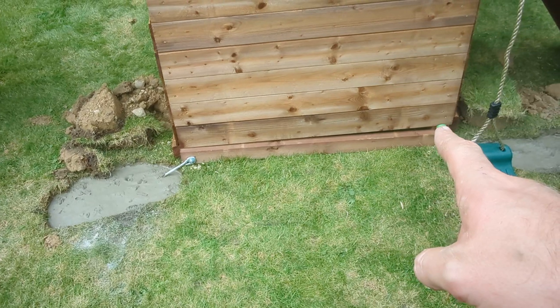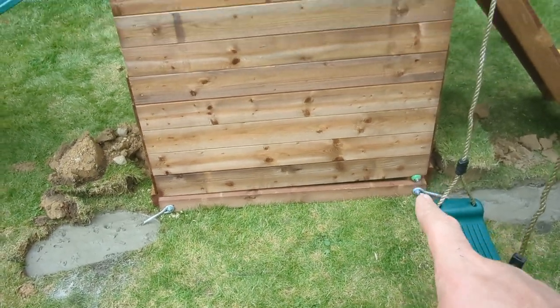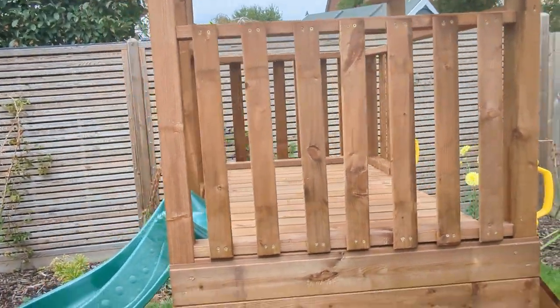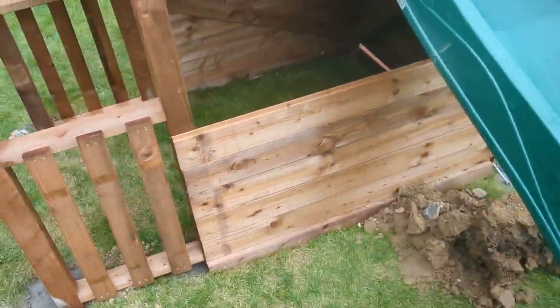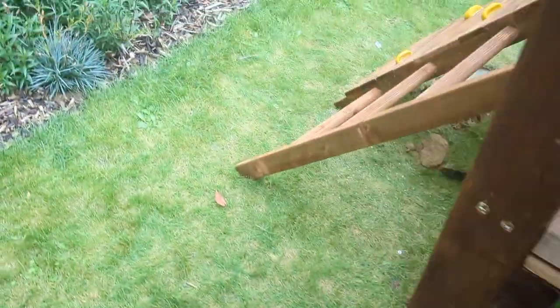Basically this board here is running completely along the floor, then the boards above it go up straight from that. I wanted to have the ground boards on the ground — it just stops any movement. It means that if there is any subsidence, and the clay is going to dry and swell and shrink, there's a solid board running across the floor.